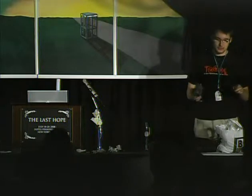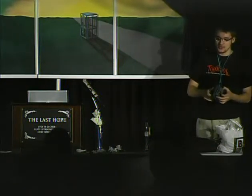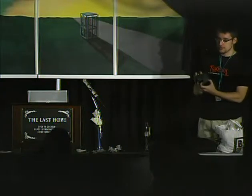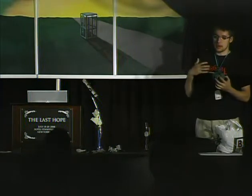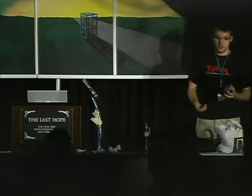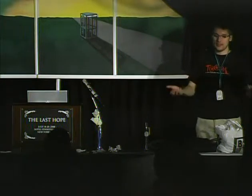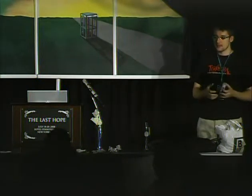Now, nobody except for the couple guys here in the front can see what I'm doing, but I'm going to do it anyway, just for their benefit. When you twirl it, you can watch the gates move under the fence. And by just sitting and playing with it for a couple hours, you'll have a very intuitive sense of how the lock is working, which is going to help you when you're spending 5 hours at the door wondering what the heck is going on because the safe isn't opening.